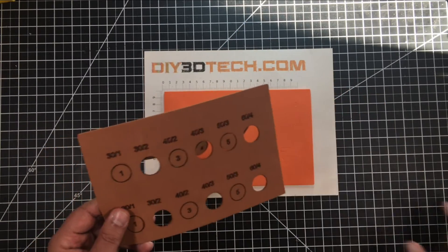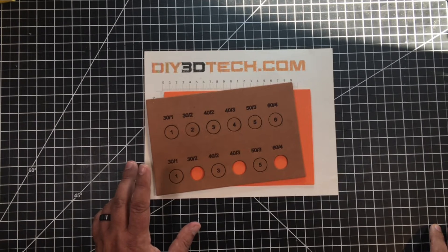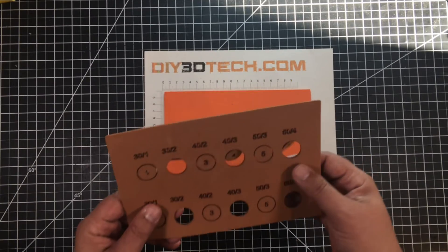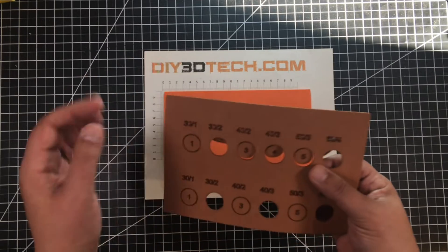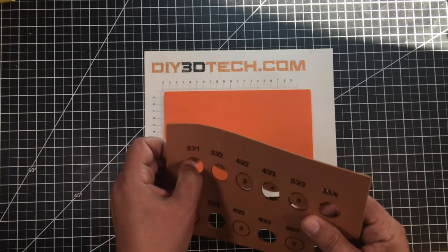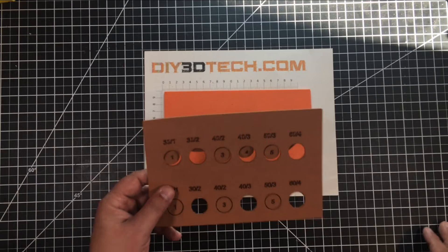So I'm giving the G8 a big thumbs up — I am super impressed. It just goes to show you that I probably picked up about 20% on the beam in comparison to where I was with the standard lens, and you can definitely see it show through here. This 60 by 4 and this 50 by 3 basically falls out too, and this 40 by 2 pops right out. Even the 30 by 1 can be popped out pretty cleanly — it's got a little bit of elephant footer edge on the back, we didn't fully cut all the way through. But I got to tell you guys, this lens is amazing.